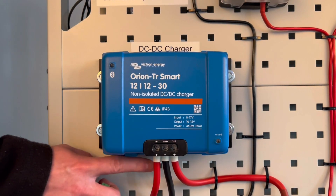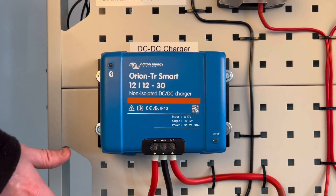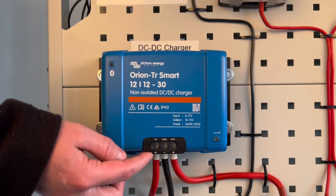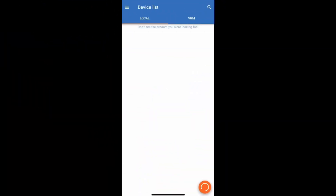For the purposes of this video I won't disconnect the cables, but all you'd need to do is strip the insulation off the end of the cable leaving the bare copper, insert the bare copper into the screw terminal, and then screw down on it and make sure it's nice and tight.